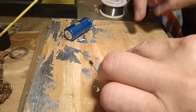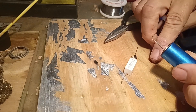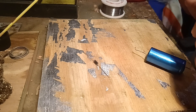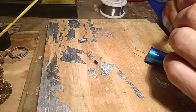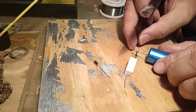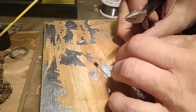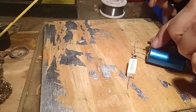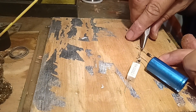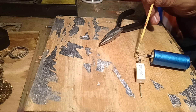Snipping the wire that was extending, and now we're going to add the capacitor, again making a little loop in one of the wires so that it will remain quite stationary while soldering. The electrolytic capacitor is normally marked with a plus or a minus, otherwise you'll see there's an indent on the one side that is normally the positive side. I'm trying to balance the components so that I can solder them, and there's the diode that goes with the capacitor. Adding some flux and getting ready to solder them together.